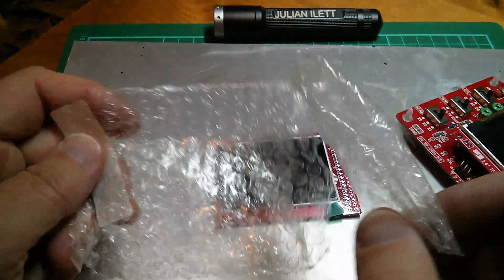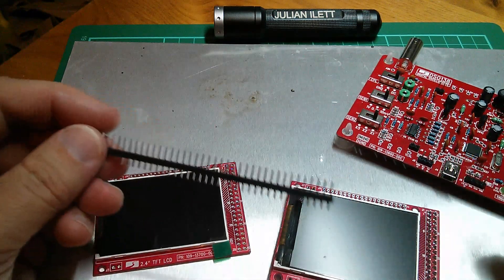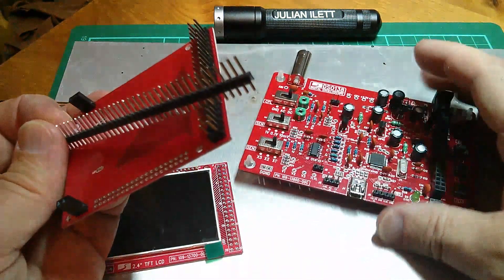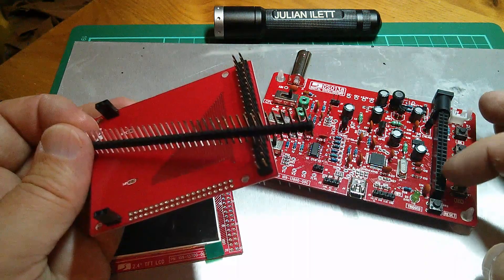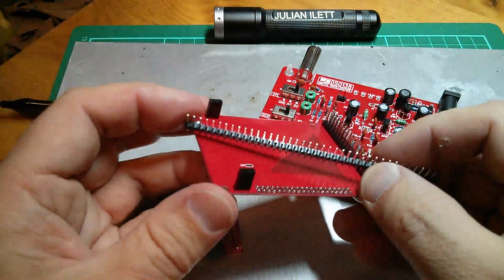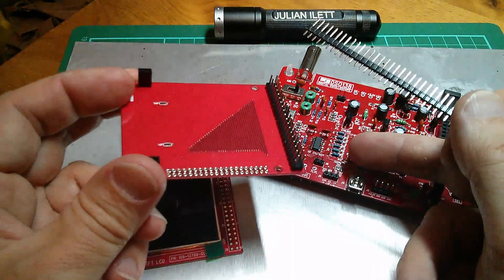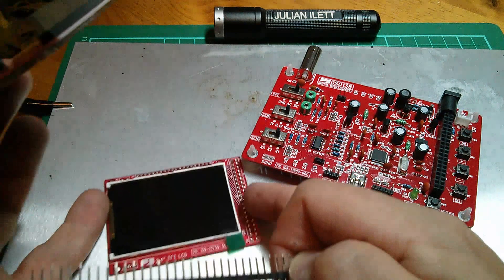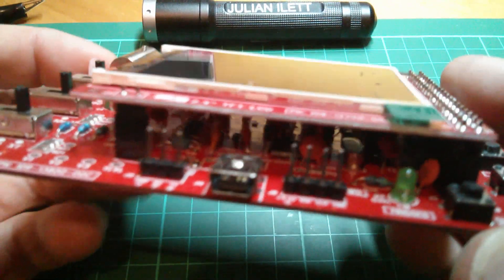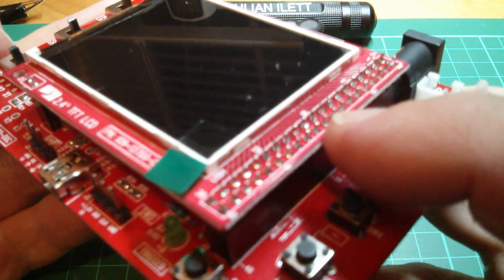Right, no connectors — I noticed that — so I'm going to have to fudge something out for those too. I can only find this single row of pins so I haven't got a double header, so I'm going to have to put the two singles in and solder it while it's in the board. I'll earth my soldering iron to this, although it should be earthed anyway. Right, that's all done — the mounting points are the right way up now, all the pins have been soldered on the LCD.